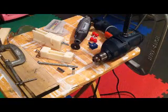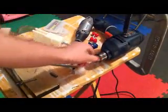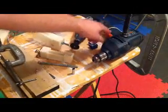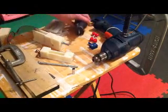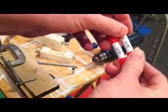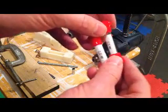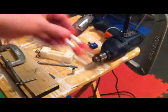These are the tools I use to make the hot end tips. I've got a TV tray with my hand drill clamped to it to hold it stationary, with a zip tie slipped over the button for hands-free operation. I also have my Dremel tool that I use to shape the tip. I also have a couple of different varieties of drill bits — you can get these where the shank size is the same as the drill bit diameter, and I've got a couple of different sizes of those.